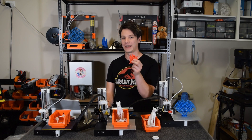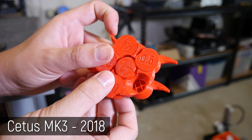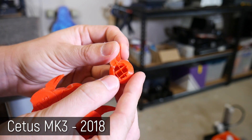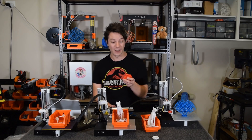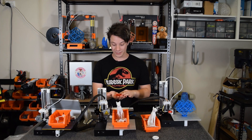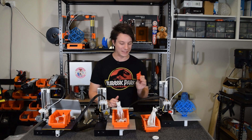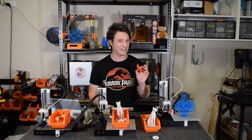And lastly, my clearance and tolerance gauge — this one is disappointing and goes back to my issue with the slicer. Everything was free with a little bit of assistance down to 0.15mm, but it broke: 0.15 delaminated and the top broke off, though it's still free after levering with a screwdriver. It only broke because those walls are too thin and it wasn't strong enough. I usually print with three perimeters when I print this tolerance and clearance gauge, and that is the only reason I think it failed. You can go down to 0.15mm clearances on all of these machines, but the slicer seems to be a limiting factor for strength detail parts.